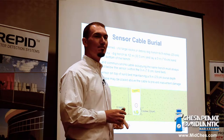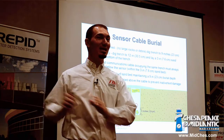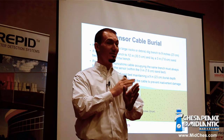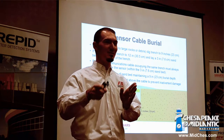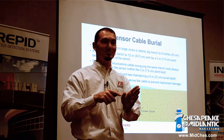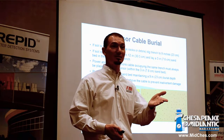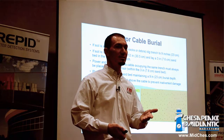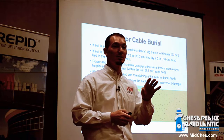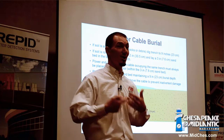This scenario could work on the other side of the fence — you could put one set of cables on one side and one set on another side, with the fence not in the detection field. However, you can't put a transmit cable on one side of a metal fence and a receive cable on the other side to create a detection field. Every time metal touches metal with an RF frequency introduced, that's a make-or-break connection — a short or an open — which means nuisance alarms.